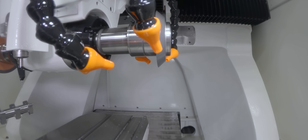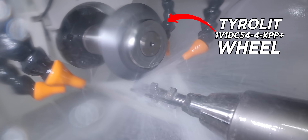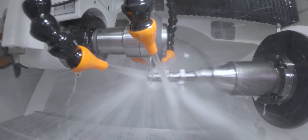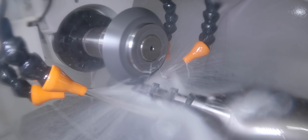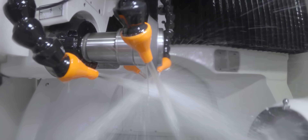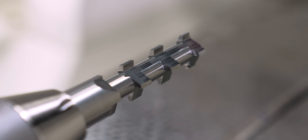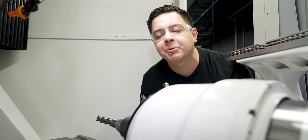To make this easier I'll do the same thing for each tool, but there's one major difference. With a 1A1 wheel I'm going to have trouble getting to the back of the part, so I need to go to a 1B1. The reason I have to use a 1B1 compared to a 1A1 is that the 1B1 will follow the profile correctly, whereas the 1A1 will give me a lot of trouble. We just finished doing the front and back OD clearances and 45 degree clearances — they look absolutely perfect. The next thing is to copy this operation to the next two slot cutters and we'll be finished with our custom carbide tool.